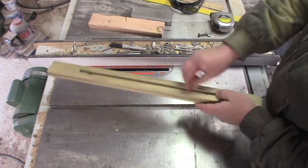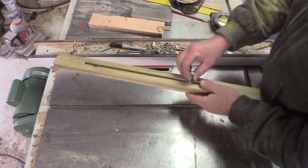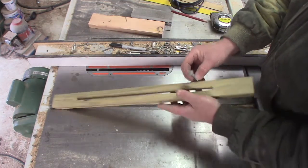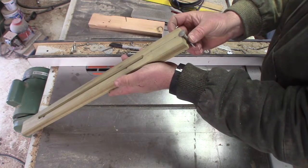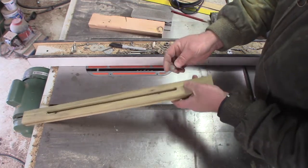Now I've got a straight groove — the pencil's going to go through. I switched over to a carriage bolt — I got a little carried away if I'm honest. So I suppose the next step is to cut the groove for the carriage bolt itself so that it will clear going up and down.